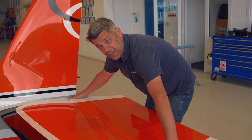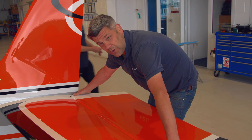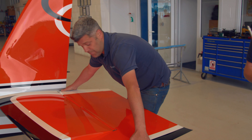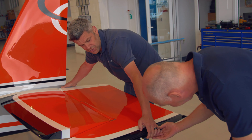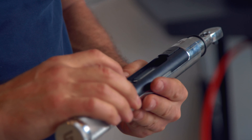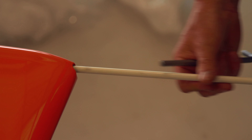While waiting for Gareth, we've just connected up the electrical trim tab on the elevator. I'm just waiting for Gareth to come and put the hinge pin in. Here we have the elevators on, all torqued up, safe and secure. Step one complete.